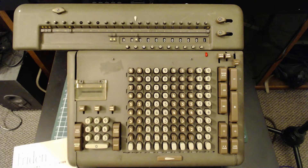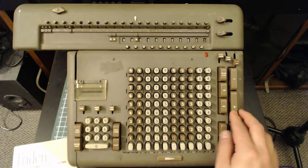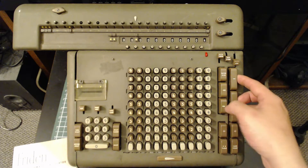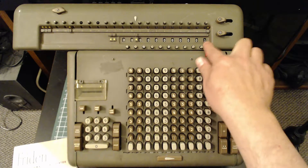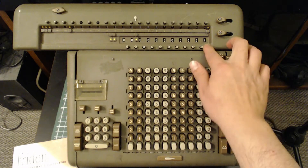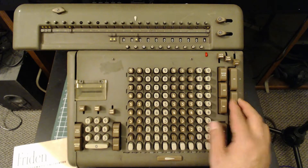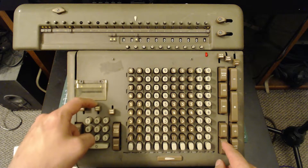To prevent that, we can pull div stop down and that doesn't happen anymore. The next thing we'll use is the counter control — this reverses the lower register counter, so addition now counts down. It still adds up but it counts down; subtraction counts up and it still subtracts.